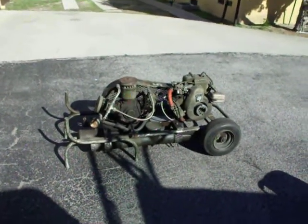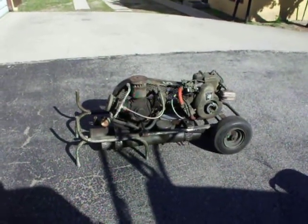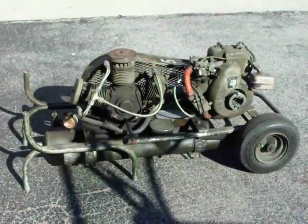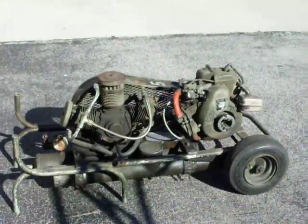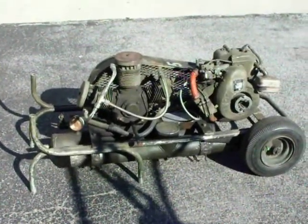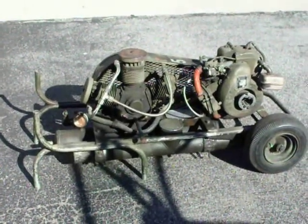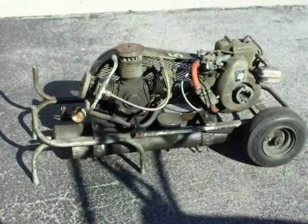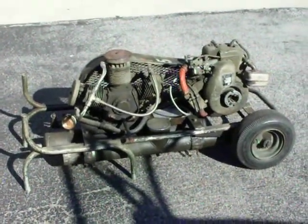When I bought it, it was in pieces. I had to reattach the fuel tank. I believe the air tank is about 3.5 cubic feet. I cleaned the carburetor, put everything back together, made a new gasket between the carburetor and the intake manifold, and changed over the copper air lines and the copper fuel line to AN fittings and Aeroquip fuel lines. And the thing's never let me down, so there it is.